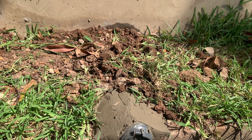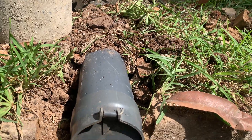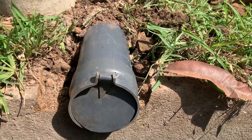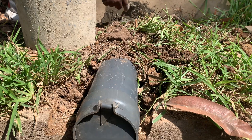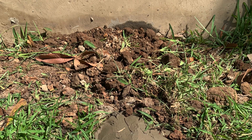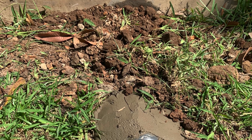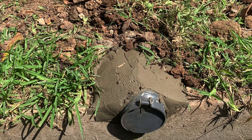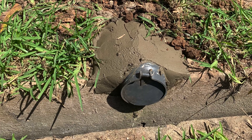What you have to do is connect your pipe — four inches or three inches — and do the necessary chiseling, then have the pipe laid out into the gatter or into the drainage system. Ideally, we fit a non-return valve cap at the end of the pipe so that no animal or anything else can pass through it, and whenever there is water inside the digester it can pass through that pipe and go into the wastewater drain system.